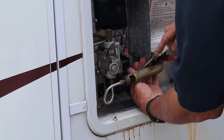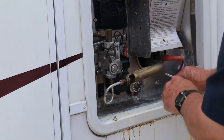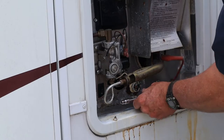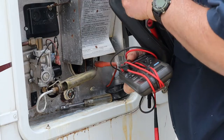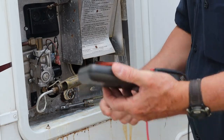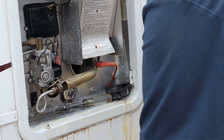I'm just getting the screws out — there's only two screws in it. One of them is broken or missing, so typically you would have three screws to get out here. There's the end of our heating element. The customer had this heating element changed not so long ago, and apparently it worked okay until very recently. He suspects that the element is burned out again. So I've got my meter out on the AC scale — let's see if we have any power across the heating element.